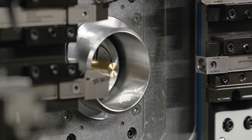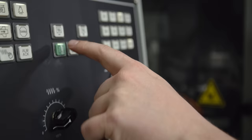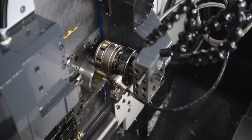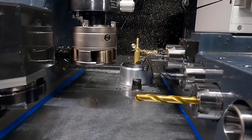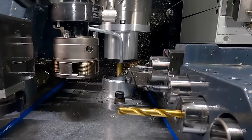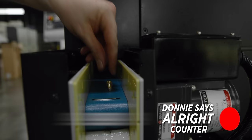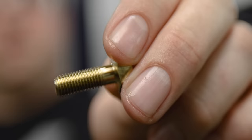I've got a few different materials I've never rolled before, so let's throw them in the machine and see how they do. First up is brass. We all know this is going to work, but the real question is whether it's going to look good. Honestly, not too surprising — the brass worked perfectly. I was expecting it to potentially flake, tear, and not look good, but you can definitely roll brass. That's awesome.